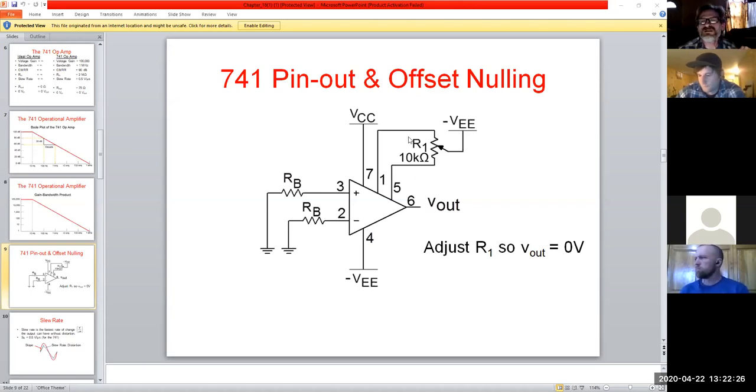And so you would basically set this up as, see how the circuit's set up where you literally have no inputs going in. They're both grounded out with resistors for any ground bounce, right? So that way you're ideally getting 0 volts. And so what you're doing is setting this thing to have the minimal amount of offset. If you were to monitor what the voltage output of this is while you have these grounded out, you'd have to do this on a scope, right?